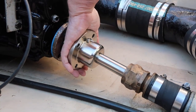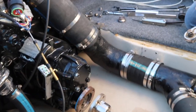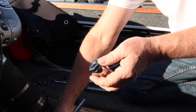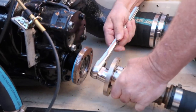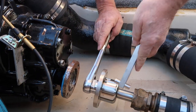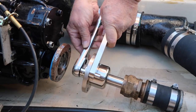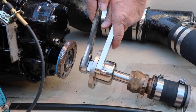Once your set screw is loose, now we're ready to remove the retaining nut. This is an ARE retaining nut remover. On the backside you can use a half inch drive ratchet or an open-end wrench if you don't have room between the two couplers to get your ratchet in. We should have enough room on this one. This is the ARE coupler wrench, and that will hold the drive shaft so that you can remove it.